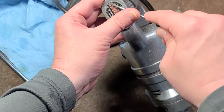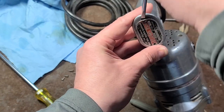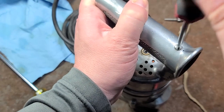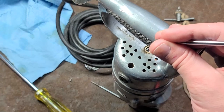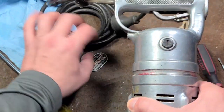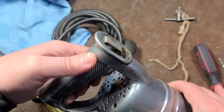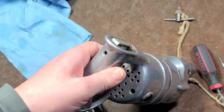And then the last screw holding in the trigger unit itself. That was probably the biggest Achilles heel of these old tools. And why I like old tools, but really from the 50s or newer, because when you start getting into the 40s and 30s, wiring was not as big a priority, and it ends up being just a real nightmare. I've run into a lot of different drills — Thors and all sorts of brands — where it's just an absolute nightmare trying to rewire them, no thought was put into it. These aren't split cases, so it's a bear to try to get the trigger units out like this.